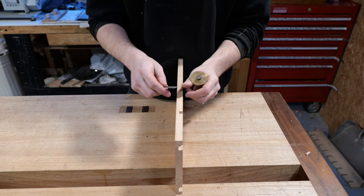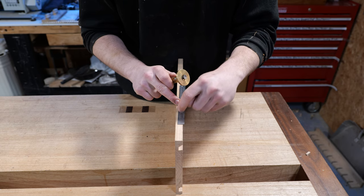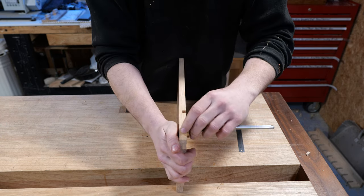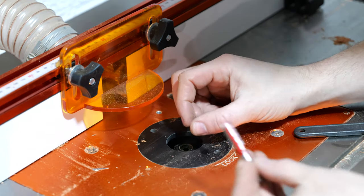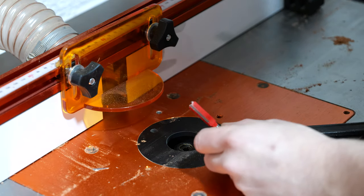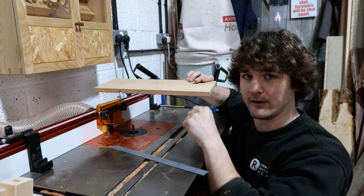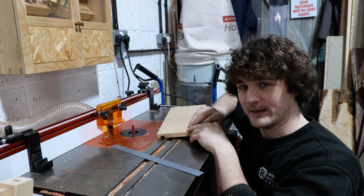As for how far the rebate goes in terms of the piece's thickness, let's make it about 10 millimeters — that way once the panel is inset within the rebate we've still got plenty of meat to get screws or panel pins in to fix the back panel in place. If you make the rebate too shallow you'll struggle to get fixings through it. I'm going to use the same 10 millimeter cutter. You don't need a dedicated rebate cutter for a small rebate like this.